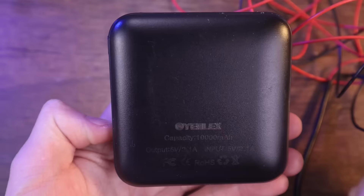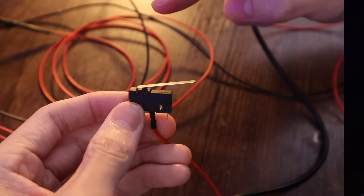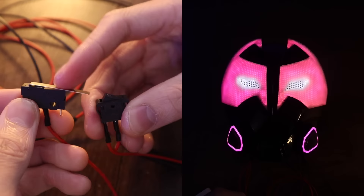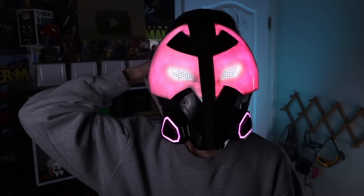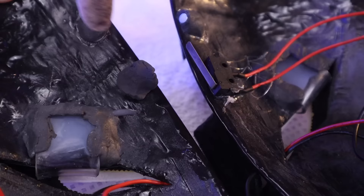Now, if we plug that USB cable into a 5 volt power bank, the LEDs should activate as soon as we press down on that limit switch. However, notice that when I flip this rocker switch, the LEDs don't turn on anymore — so essentially that means the rocker switch is like the master switch. Having this master switch is nice because those LEDs will drain the battery a decent amount, so it's good to be able to quickly turn the LEDs on and off in a pinch. If I glue the limit switch right to the edge like this, I can make it so that when the two halves of the faceplate touch each other, it makes contact with that limit switch, allowing the LEDs to turn on only when the faceplate is closed.